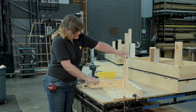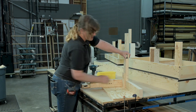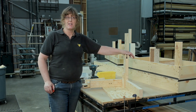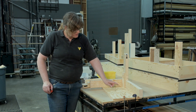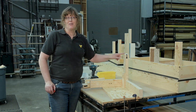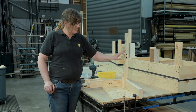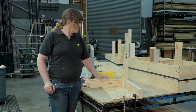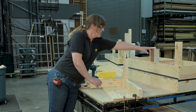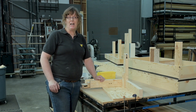That's basically it. Now you see I do have a little bit of flex in a certain direction, and especially if I get a longer leg this is going to have a lot more flex because I'm not really secured here. So it requires cross bracing everywhere, and that will strengthen this up and make it a very strong structure. All the weight of the material is going through the plywood into the framing, down the leg — I'm not putting any of the stress on these actual screws. It's kind of like the way we assemble soft flats together with corner blocks and keystones and half straps — same principle.